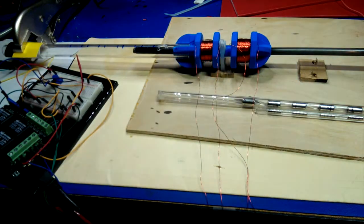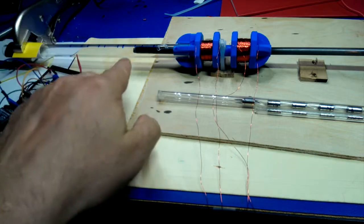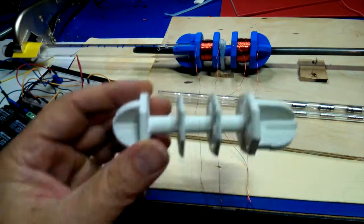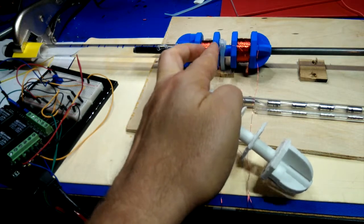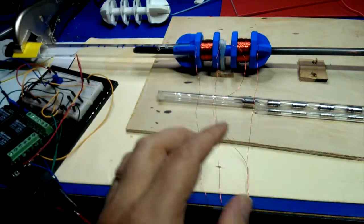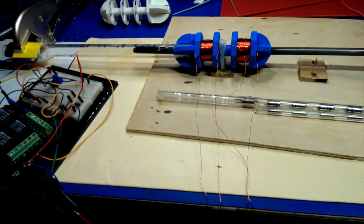although I need to make some improvements. You may be able to see the blue marks where the system stops. It stops exactly at each of these step points, and they're not even, and I think that's because I made these coils actually a little too wide, wider than 1/2 inch, so I'm going to modify this model to make these coil spacings even shorter. So they'll be a little bit shorter than 1/2 inch, which should hold the magnet directly in place and hopefully be regular. I think the reason these are not lined up is because this coil is too broad. At least that's my theory.